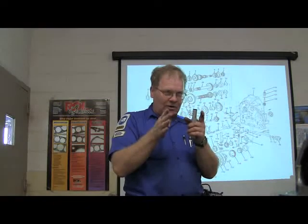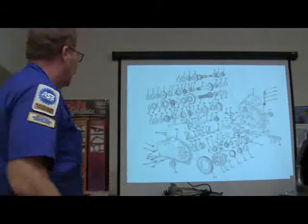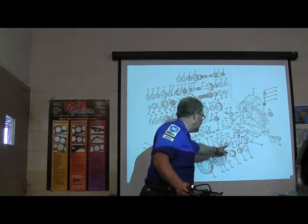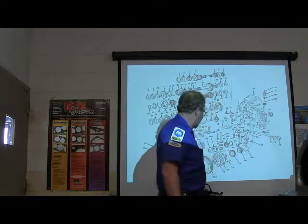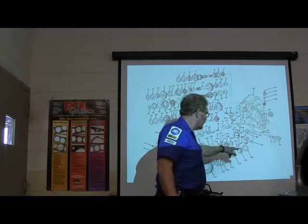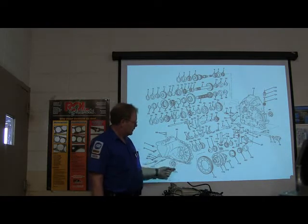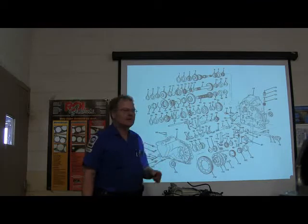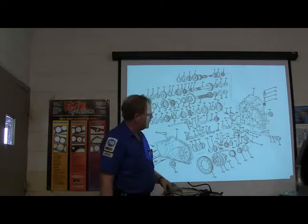Did you know that even little tiny radio control cars have got those spider gears in them? This shaft right here is what those little gears are in. Where do these gears connect to? This little shaft right here is going through the differential case, which is down here. There's your ring gear. These two right here go to the CV axles — the CV axle just clicks into that gear. There's another one on the other side. That's the shift rail right over there.